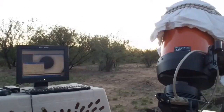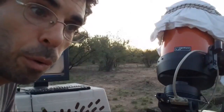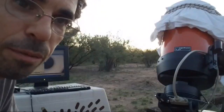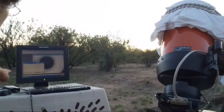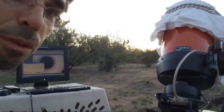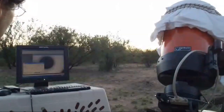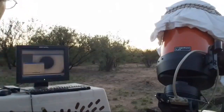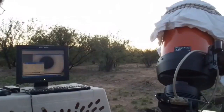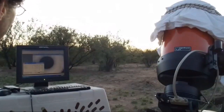getting unsaturated here. This is a 16-bit camera, so the data values go from 0 to 2 to the 16th minus 1, which is 65,535. And so I can look on here at my maximum data value, and it's still 65,535, so it's still saturating, but it's getting better. It's kind of a weird looking flat field. Pretty weird looking, but I'm still saturated. Okay, so now I've just come out of saturation, and wow, what a weird flat field.